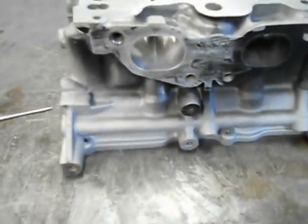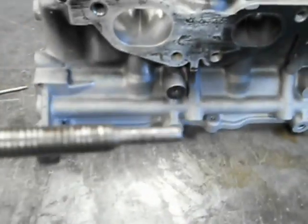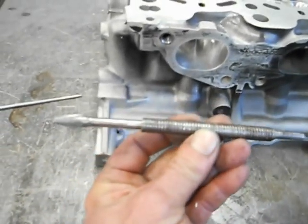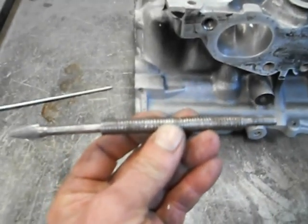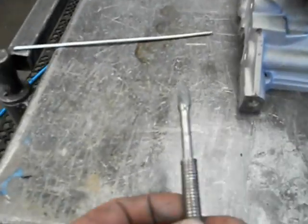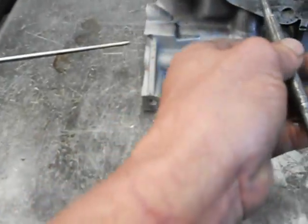Just what I do to get right down these long ports — I've got a bit of stainless steel threaded bar, turned it down to a quarter inch in the chuck to go in my die grinder, drilled a hole less than a quarter of an inch in this side and just press my burrs in. So there you've got an extension. When roughing out I get this in the die grinder and give it a whack so it puts it out of round a bit — it vibrates and cuts more material out. Then I just get my die grinder in a vice with a dial indicator and straighten the burr back up to give it a nice final finish.